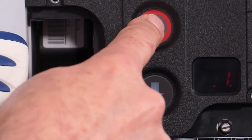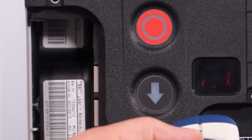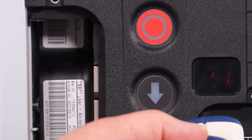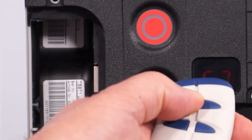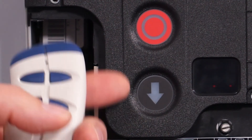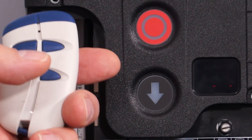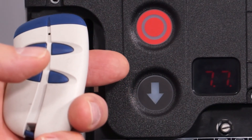You can see the line rotating. While it's rotating, push the button that you want to use on the transmitter to operate the shutter. At that point the display changes — you get a pair of brackets come up showing that it's been programmed in, and then it reverts back to 7.7.